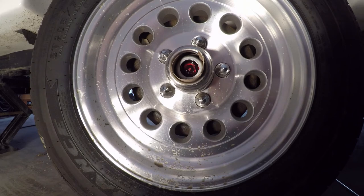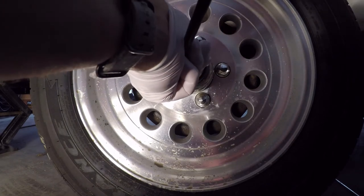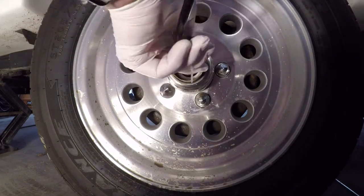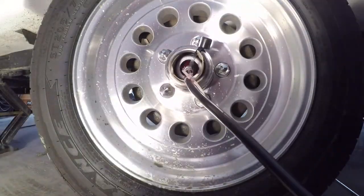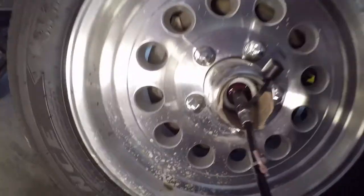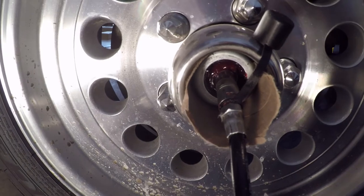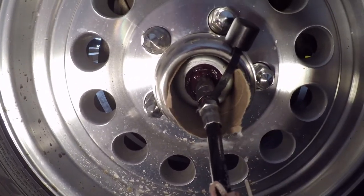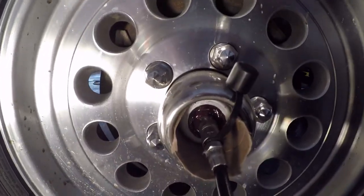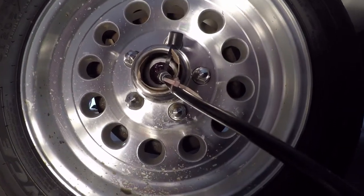I got my grease gun loaded. If you don't know how to load a grease gun, there are lots of YouTube videos on that — it's pretty simple. The Zerk fitting is inside of here. Push on until it kind of clicks a little bit and then start pumping. You can almost see the grease growing, it's coming through. I'm going to basically keep pumping until it fills up, then take this off, scrape out what I can, and do it all over again — probably about three or four times.